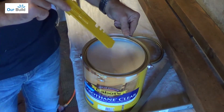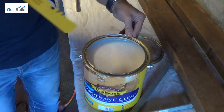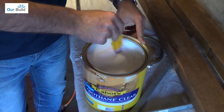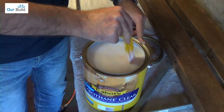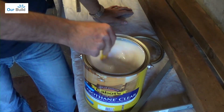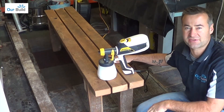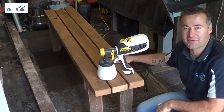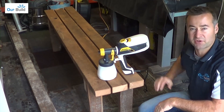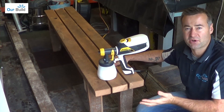With this urethane, you can see it's a bit milky on top. It's recommended not to shake it, especially going through a spray gun, as you don't want any bubbles. So I'm just going to use this broad knife to stir it up. It's got a thick creamy coat on top, so we just want to get that all the way through. Ideally I'd like to spray outside, but it's raining so we're in the garage — it's a little confined. The main thing is give the timber a dust off, make sure there are no fine particles on top, and then apply the first coat.